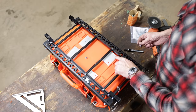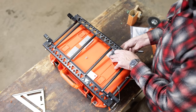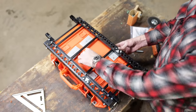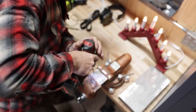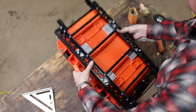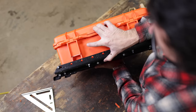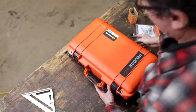Let's see how our tabs worked out. On this side I made that hole a little bit bigger so we could adjust it a little bit. This is not the hardware I'm going to use — I'm going to use stainless steel with nylock so it doesn't corrode and doesn't come loose. I'll pick those up at the hardware store later. Now you live and learn: as high as that got raised up by that quarter-inch bar, I probably wouldn't have even needed to cut that. I learned my lesson slow.